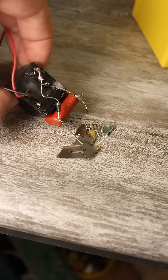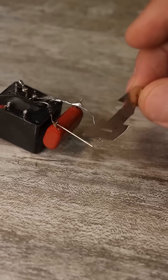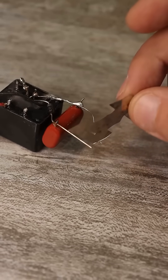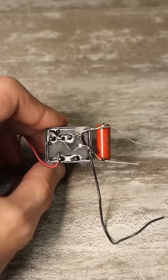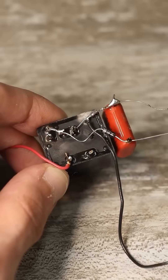The coil is an inductor, and due to the phenomenon of self-induction, at the moment the current is turned off, it will release the stored energy in the form of a self-induction spike. The EMF of self-induction is many times greater than the supply voltage, and it has the opposite polarity — this is where the reverse connection of the diode comes in. The voltage will accumulate in the capacitor, and after a couple of seconds of operation we will get 200 to 300 volts.